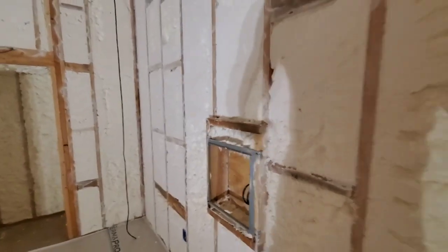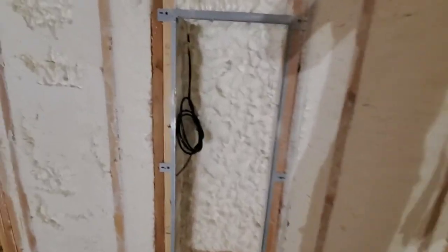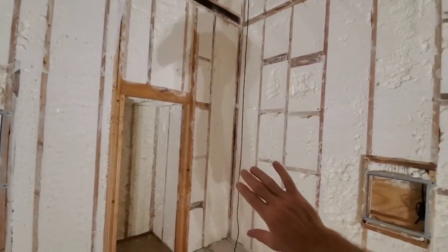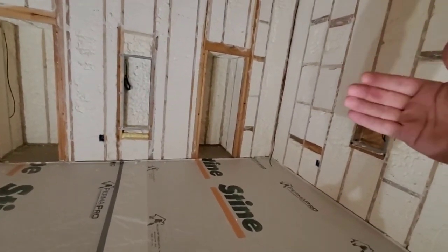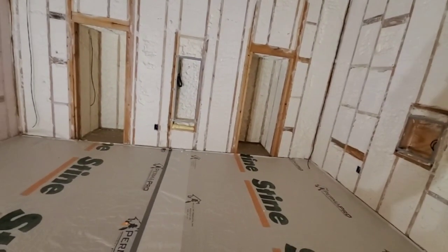Right here the same thing — this is a six-inch in-wall for the wide, so we had to shim it out a little bit. Once we put our acoustic material in here, we'll have acoustics all in this room — some on the ceiling, scatter plates manipulating the sound the way we need to. It's going to be nice and seamless, you won't see any speaker in this room. Over here we've got a Triad Gold for the center — a Triad Gold LCR, six inches deep, so we had to dig out a little bit. This is actually an eight-inch deep alcove I built because I wanted a little insulation behind it. After sheetrock, we'll build our columns in the corners for the flanking sections for the mains — those are also bass traps. The area right there has to be angled anyway — that's how you get people thinking in-walls aren't good: they're just not installed properly.